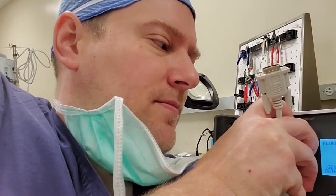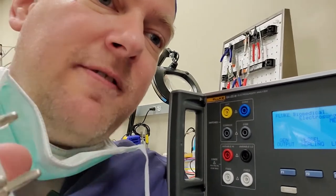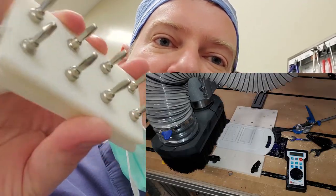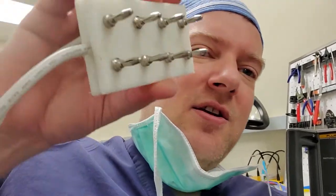This plug part right here — I measured out the pin holes, their spacing, which is 25 millimeters, and I created a CNC CAD file for this unit. This is actually just a prototype made out of a cutting board. You can see I've got a whole bunch of banana plugs, and on the inside are wires that go from this 9-pin to one individual banana plug. The reason the female side is on the ESU side is because just in case somebody accidentally energizes the unit, you don't want a bunch of metal pins exposed. So the ESU side gets the female, the analyzer gets the male.